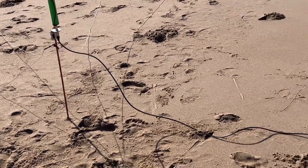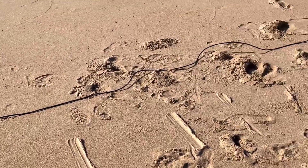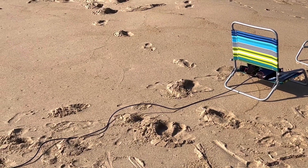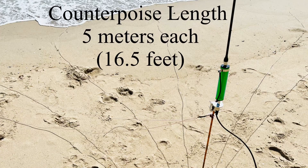And best of all, the best counterpoise wire of the whole setup is the coax, and this thing is leading directly west, right into the continental United States. Let's go ahead and fire this thing up and see what happens. One thing I didn't mention: these counterpoise wires are five meters long, or basically 16 and a half feet. With that setup I was talking into Europe with ease. One cool thing I did was make a contact at 20 watts and then take it down to one watt.